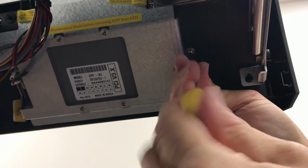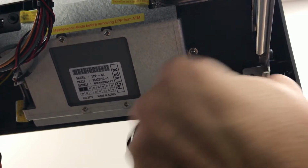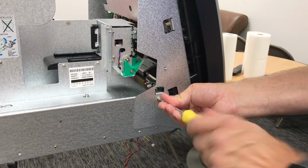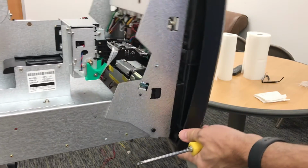Then it should be much easier to start the screws. Once you get one side in, snug it down and it'll be easier to hold the other side. While it's not entirely necessary to do this, we're going to show you how to install the cables with the bezel swung forward just for clarity. Remove the two screws on either side of the sliding tray that allow the front of the machine to hinge forward.